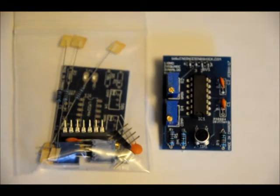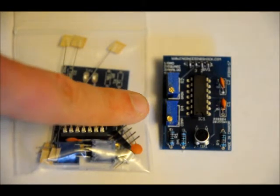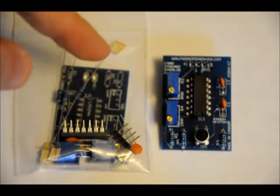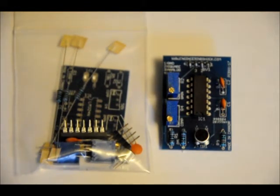For those of you who don't know what comparators are, this comparator circuit is so that you can get 0 and 5 volt signals. The comparator has a large gain on it and you've got a positive reference point and a negative reference point. The second potentiometer sets the negative reference point. So if the negative reference point is set to 2.5 volts, then as soon as the output of the first op amp exceeds 2.5 volts, the output will shoot high. When it goes below 2.5 volts it will go back down to 0. That's how we get our square wave — it's either all or nothing, 0 or 5 volts.